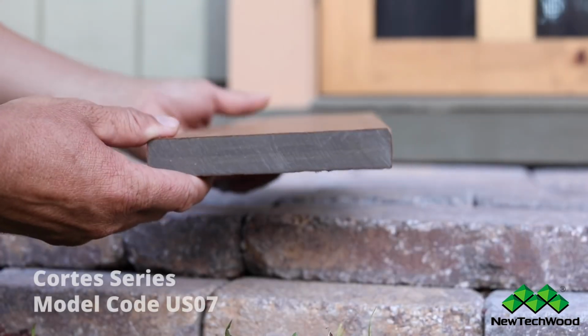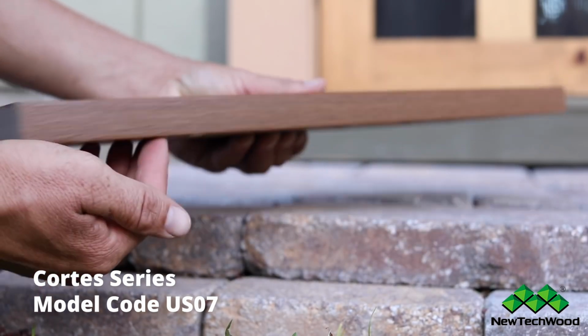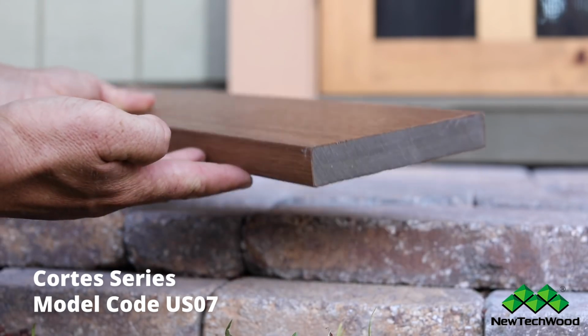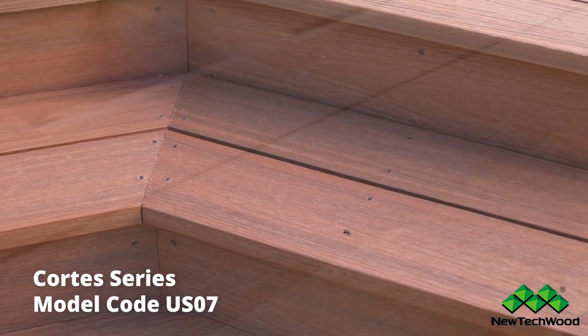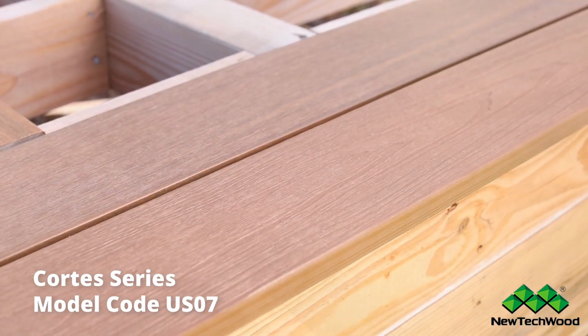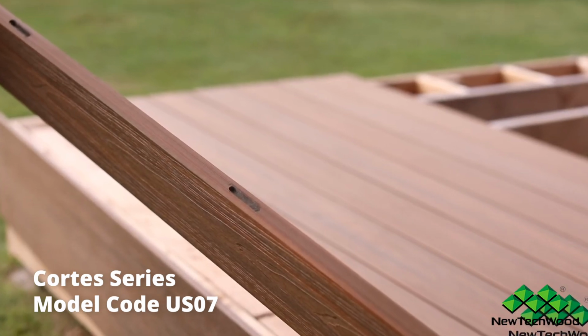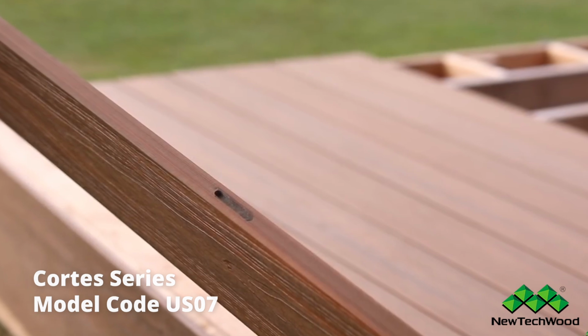The Cortes Series, model US07 board, has a solid profile without any grooves. These boards also have a straight side and a wood grain side, and can be used as stair treads or regular deck boards, and are attached with composite deck screws. They can be routed to accommodate hidden fasteners, but should not be routed the entire length of the board.